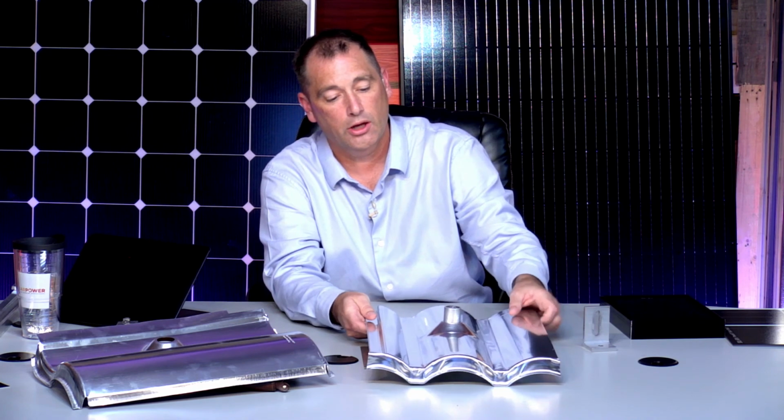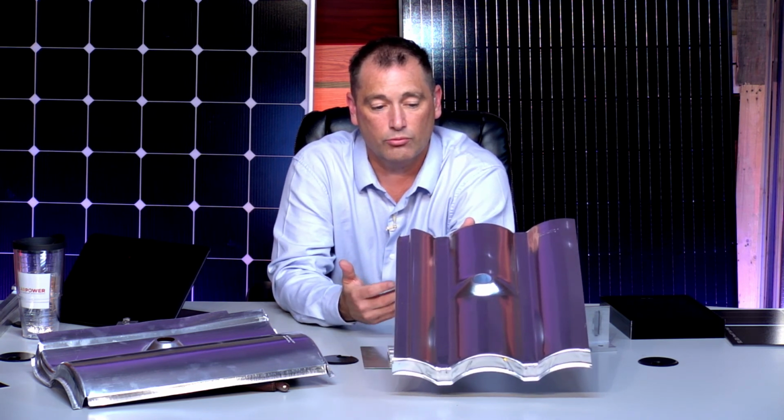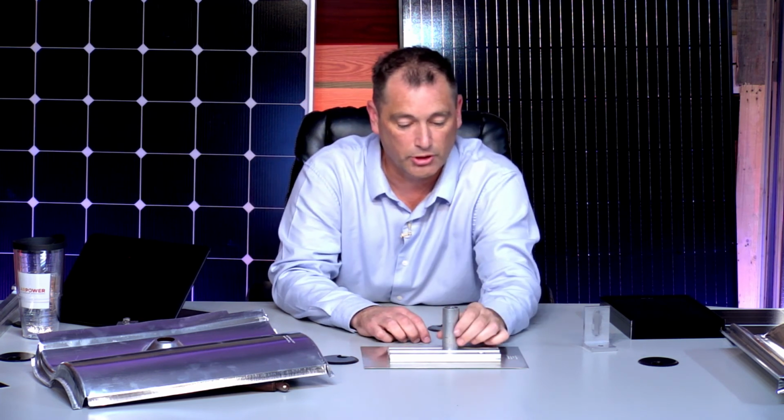And truly, the waterproofing, which I didn't talk about yet, this is honestly any tile roof. If you talk to a roofer or anybody that knows anything about roofing, the tile itself is cosmetic. That's not what keeps the water out of your roof. That's not the waterproofing portion of it. It's beautiful. It adds value. Actually, that's one roof style that adds value to a home, I believe. I'm not a real estate agent, but I think that's fact. But the waterproofing actually happens here.